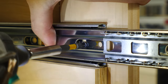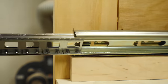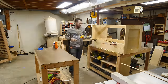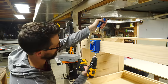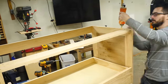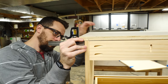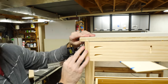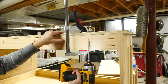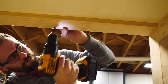Just a note: every time I have ever put on drawer slides, they've needed adjustment — that's just the way it goes. While I got those in the right place, Josh cut down all the shelves to put in later on. The next step was to cut down the top piece, and this is just a basic piece of plywood with a three-quarter inch overlap around three sides. After I got the piece centered and made sure that the overhang was the same all the way around, I drove in the pocket screws from the back side to hold it in place, and then countersunk some holes on the front stretcher so that I could drive in some screws to pull down the front edge.